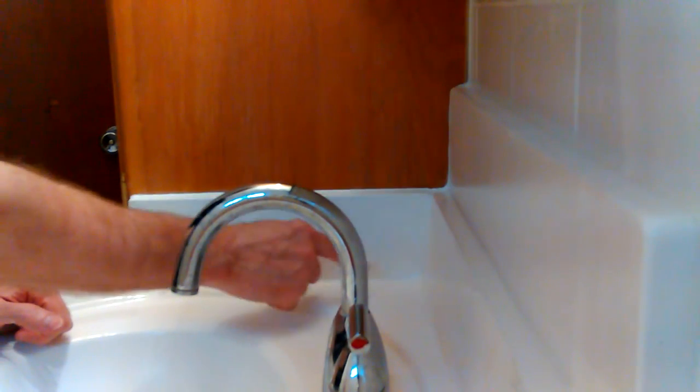This is quick and it's going to be good enough. But I will probably come back and touch it up because it's already shrinking right now. So once it's dry and shrunk back in there, I'll go back in a few days when it's dry good and I'll put another bead of caulk in there and let it fill back out - just for looks. It's really not anything to do with how well it keeps the water from going back up there since the sink slopes up. But once it dries, whatever shrunk up too much I'll fill it in - that'll be alright.